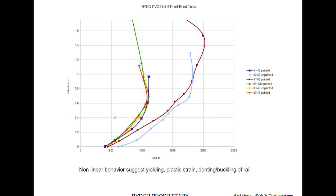When they say PVC isn't as strong after it's been subjected to ultraviolet radiation in the sun, that's not really true. In fact, most polymers and epoxy resins get stronger with age and stiffer with age. What goes down is the fracture toughness — that is when something is strained really quickly, like when you drop something on it. So it's incorrect to say the strength went down because the PVC sat in the sun a long time. The strength actually goes up. It's the fracture toughness that goes down, and that is just a function of strain rate. I'm going to make a longer video about my fracture toughness testing.